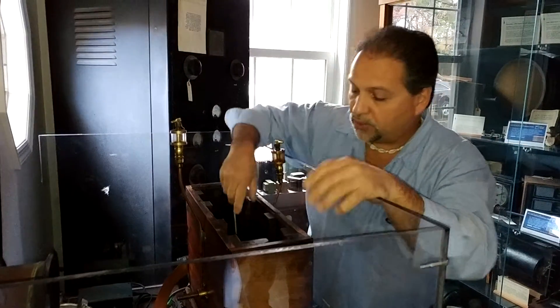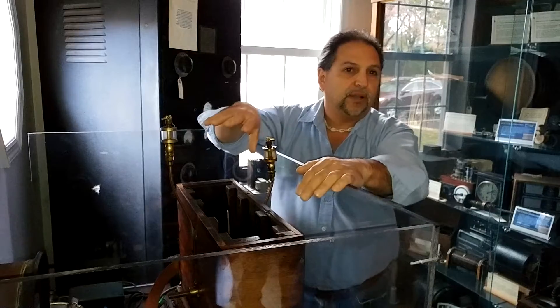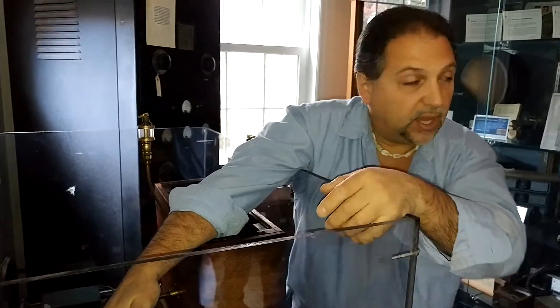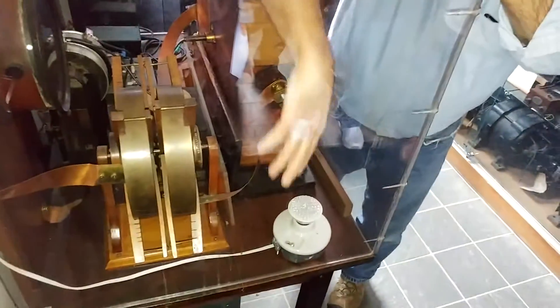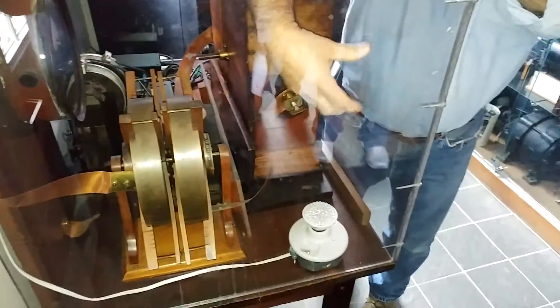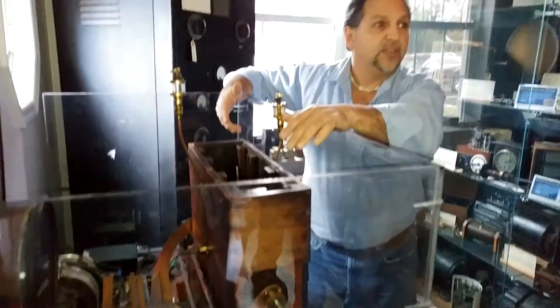Because we're keying it with a Morse code key, the air breaks down with the voltage and an arc is generated. Depending upon the strength of the arc, that energy is coupled back through the oscillation transformer, and if it's a strong arc, this light — which is wired on the output — will fire. You'll be able to hear it as well as see the arc.